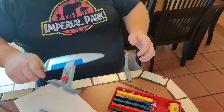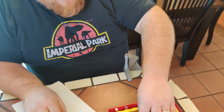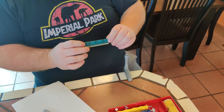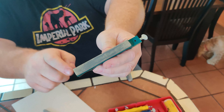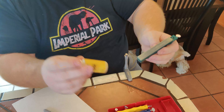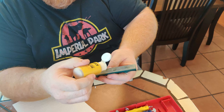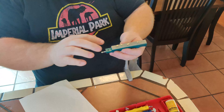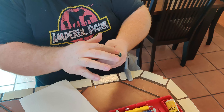It's pretty easy. To set up the stones, I'm probably going to start off with this medium stone — this green one. It's 280 grit. You can see it's got dirt in the stone itself, and that's what this honing oil is for. I'm going to put like six dots or so of oil on here, take my finger, rub it in circles, and loosen all of the metal filings out of it.